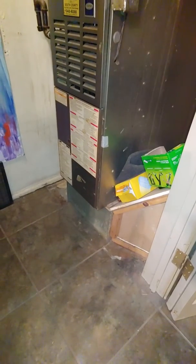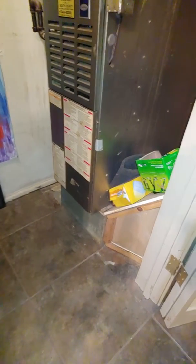Alright guys, on this replacement we need to put a 5-inch media cabinet underneath the furnace. The return is coming in through here to the left in a box and also from the back. They currently just have it sitting on top of a 1-inch, but we actually have to pull apart the furnace and put it in there. We're gonna do a 5-inch with our shorter furnace.